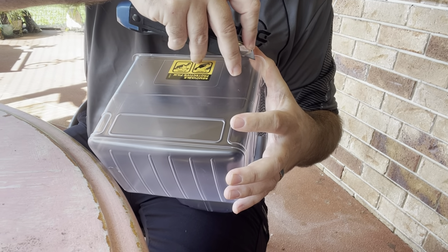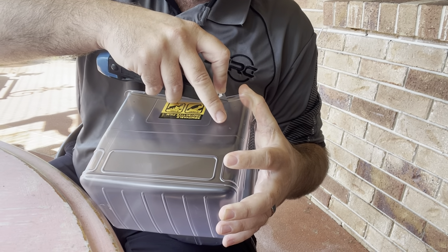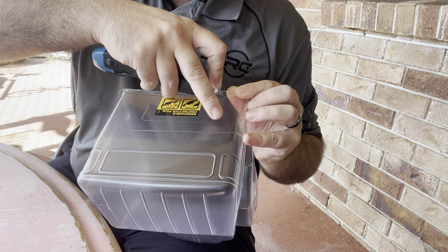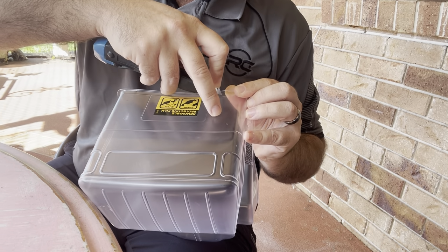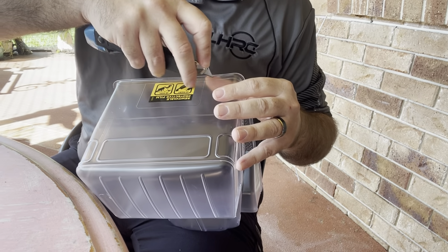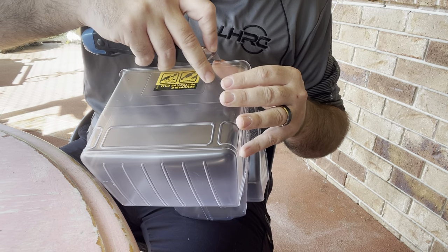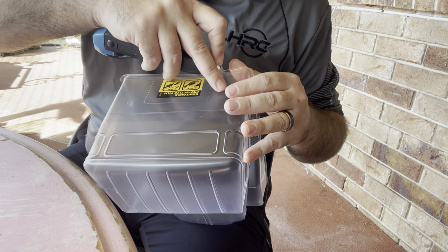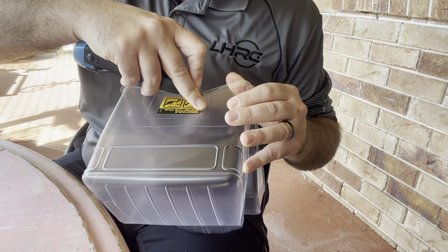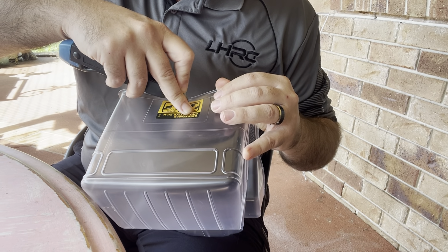Yeah. So we're starting from the edge of the curve. We're just going across. Now, I always use my middle finger, whatever the technical term is for it, as a guide, and just have that on the body. It helps stop myself from slipping or curving this way, because you can feel it on your finger as you start to walk across the face. It will also help when you slip, because as you can see on the camera there, the base that I'm cutting now is bowing in. So you have a bit more control over the blade.